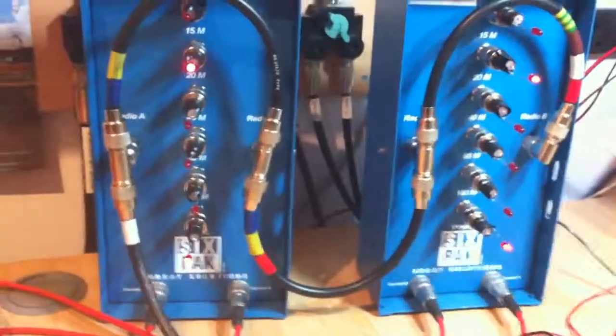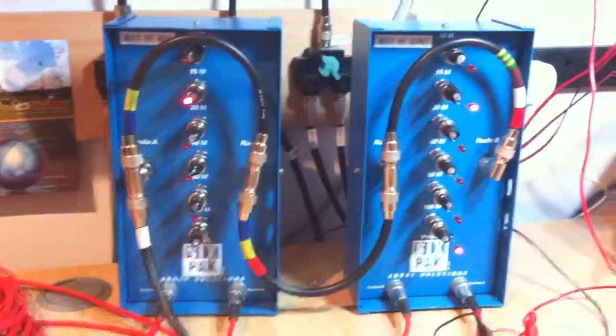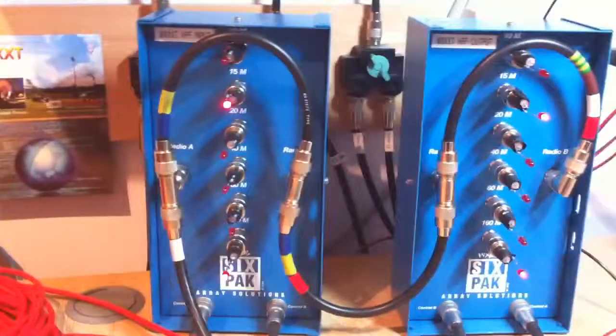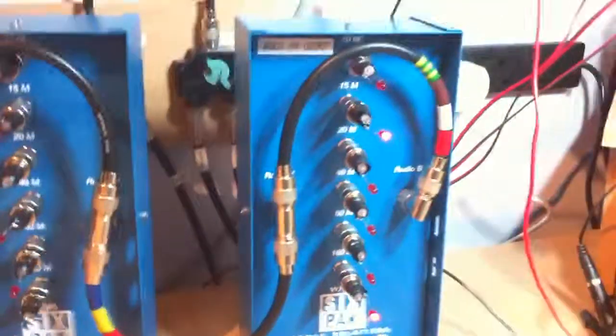So we might need to build a box just to sort that out. Worth mentioning that if you decide you want to build a similar sort of test harness to this, you need to make absolutely sure that at no point the inputs where you're feeding the voltage to supply the LEDs get switched to ground, otherwise you're going to have a short on your hands with your power supply.